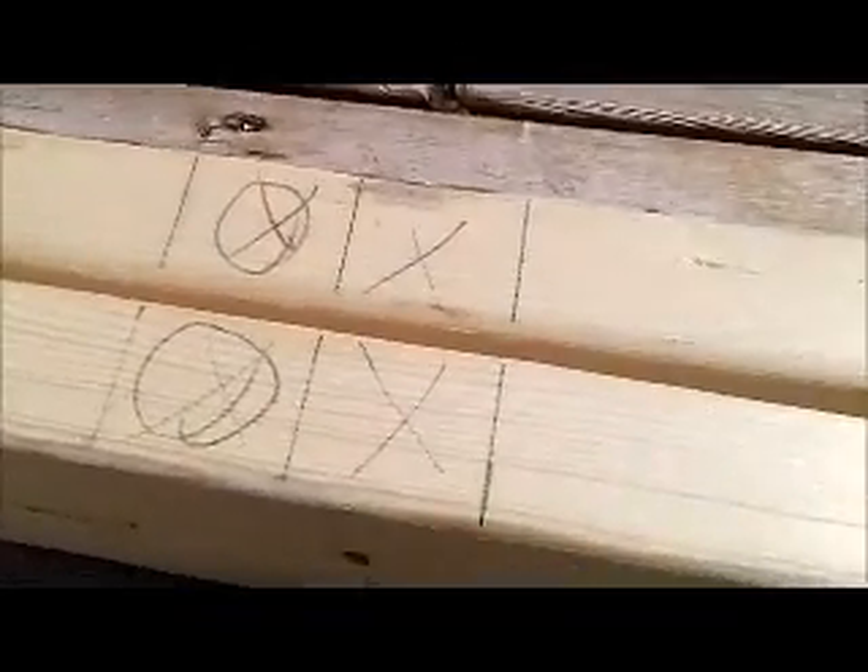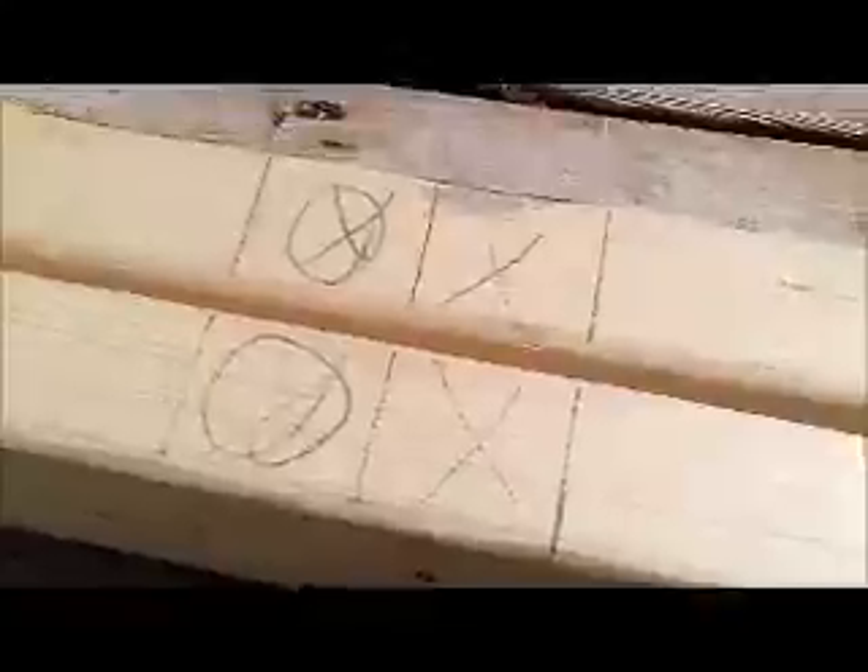So I started to prepare my other plate. For people that don't do it: you take the bottom and the top plate together so you can mark all your studs every 16 inches on center, and then you decide where your openings are gonna be. Every opening there should be a king stud. I mark the opening — the first stud — and then you get the king stud, so the center stud goes right where you put your header. Your king stud has to go all the way up, and then the other one goes underneath to support your header. That's how you usually do it, and then at 16-inch center you continue whatever you want to do.